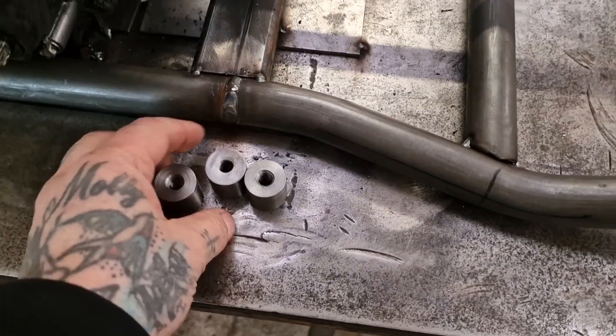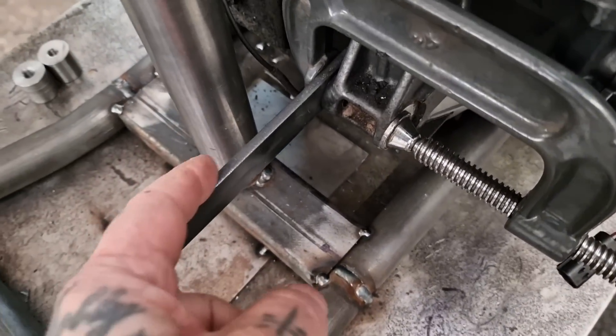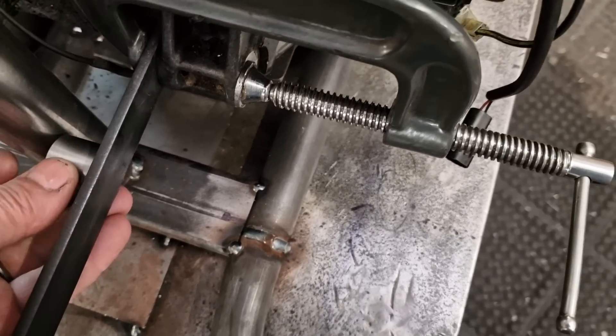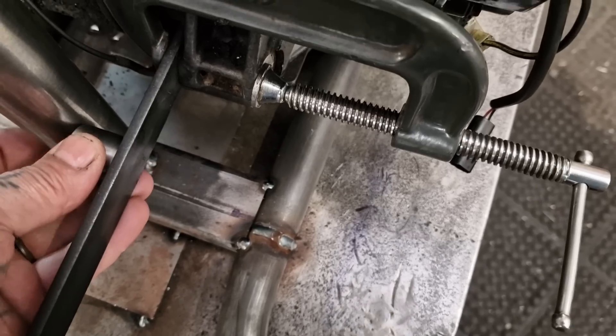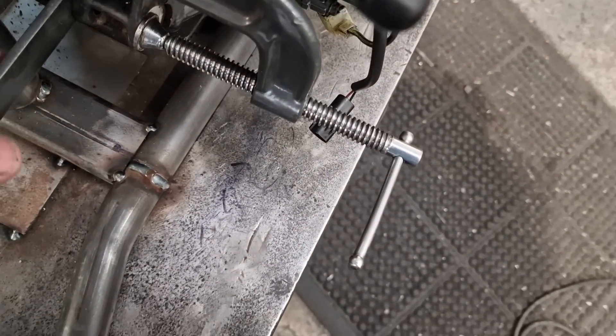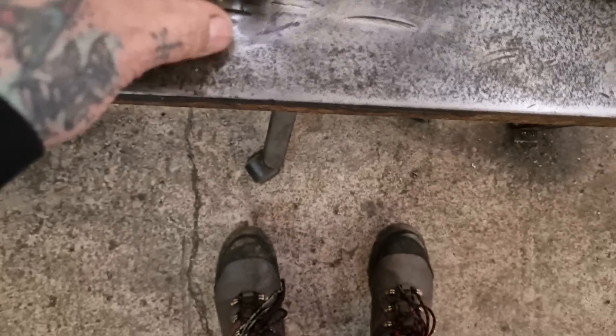I've already made three — there should be four. What I'll do is clamp a bit of bar on to represent the plate that I'm going to make, then I'll measure the gap in here and take a millimetre off, because this is 5mm and I'm going to use 6mm. So next is measure them and make them. I'll show you how I do it over on the lathe, but there's three and there should be four — that's got my head in a bit.